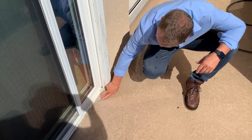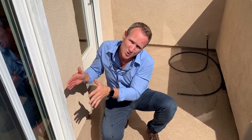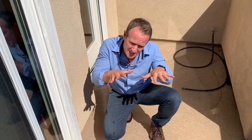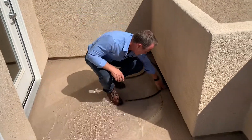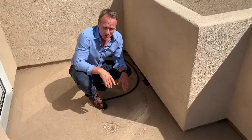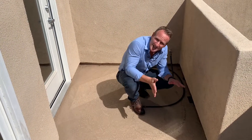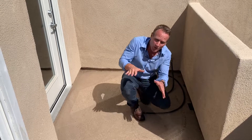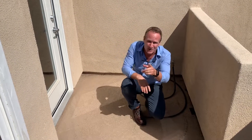We've packed the plumber's putty in here to separate the deck from the threshold, so right now we're focusing just on the deck material itself. We've also used black tape to lock the drains. After a good 30 to 40 minutes, we'll release the water and then work at the threshold and the weep screed, working our way up. We'll get back to you with our findings.